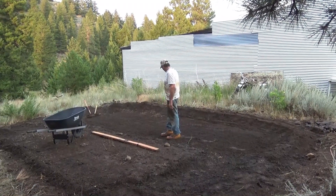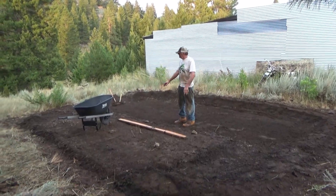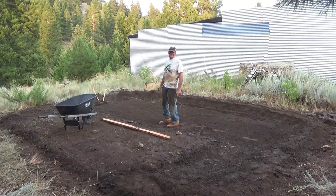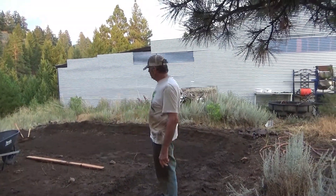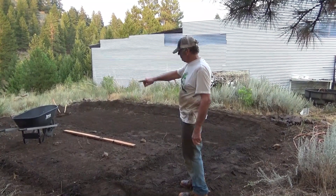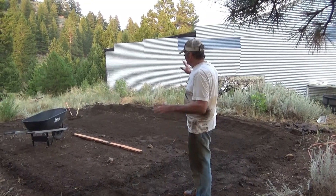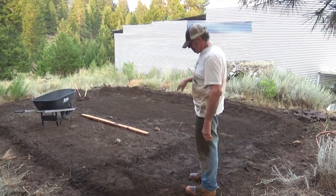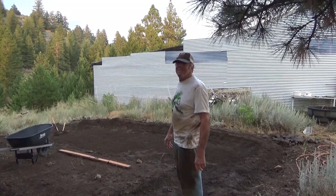So here we are at the end of the third day — we're doing pretty good. We put the berm finish there. We have more dirt on this side and less berm to build than we did on the other side, so that should give me what I need at the end because that will be the highest berm. We'll take however much material there is and distribute it evenly, keeping the top of the berm at an even elevation so when it rains it will capture all the rain and won't overrun. This will be where we take our tailings, set them, drain them, rinse them, and recover our chemicals and whatever residual gold is left in them. Back tomorrow with the final earthwork and maybe we'll even be stretching some plastic.